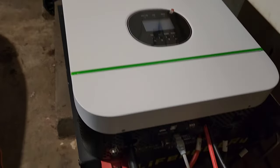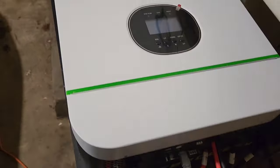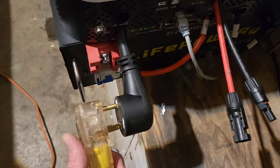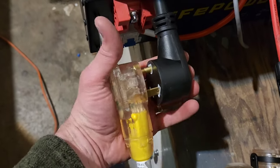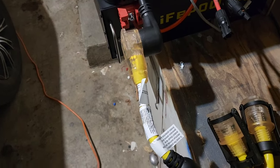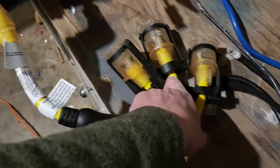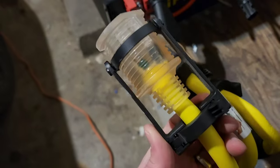This unit can output 3,000 watts continuously, and I think 4,500 watts for spike use. I'm going to use this 30-amp plug. This might be a little overkill, but if all the fridges happen to turn on at the same time, I'm hoping this will protect me. I've got these big connectors here — I've never used them before.